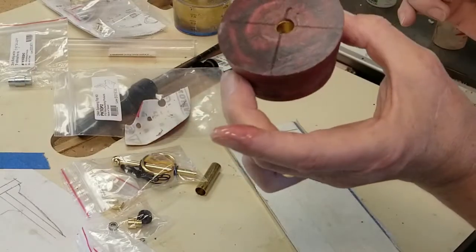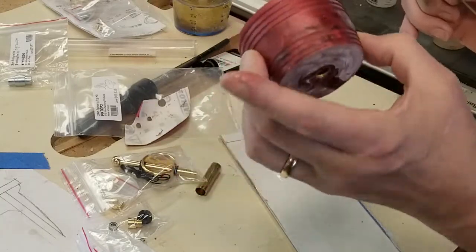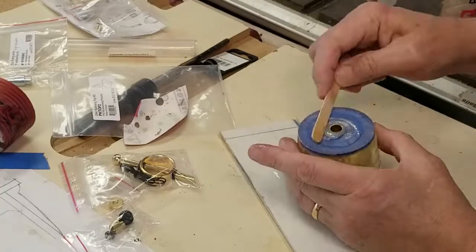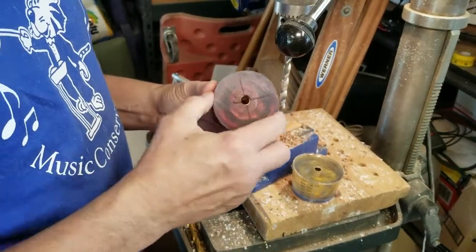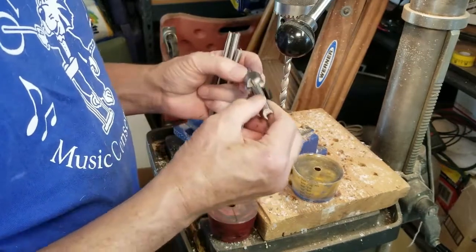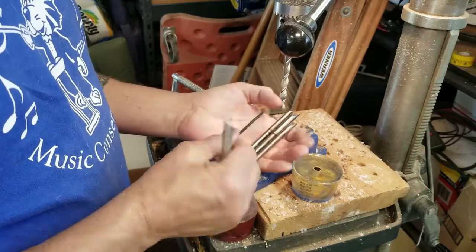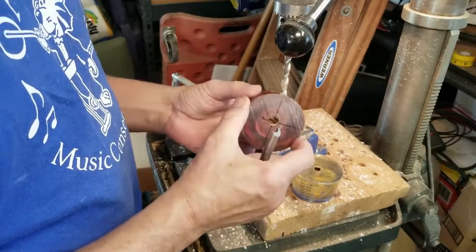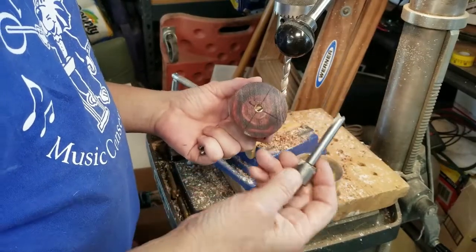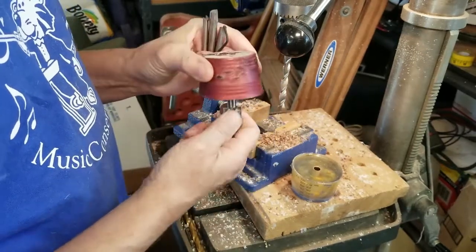Leave a little space for trimming to make sure it's all squared up before we put it on the lathe. Our next step is to trim the blank down so it is even with the end of the brass tube. For that we'll be using a barrel trimmer. These come with various inserts of different sizes depending on the size of the brass tube you need to trim. This one is already installed and is the appropriate size for our blank here.